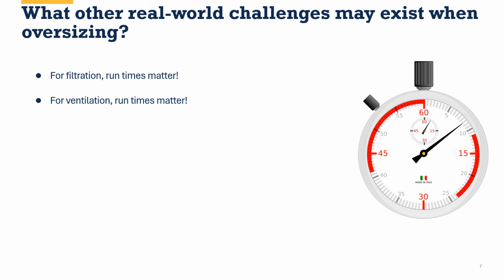The same thing happens if you have ventilation integrated in with your central air handler. If you want that to work, the air handler actually has to be running. And this could be true whether you have ductwork that is connected directly to your central duct system, or if you have a completely separate system, but it is synced through its controls to come on at the same time as your central air handler. Without the runtime, you're not getting the ventilation you think you are.